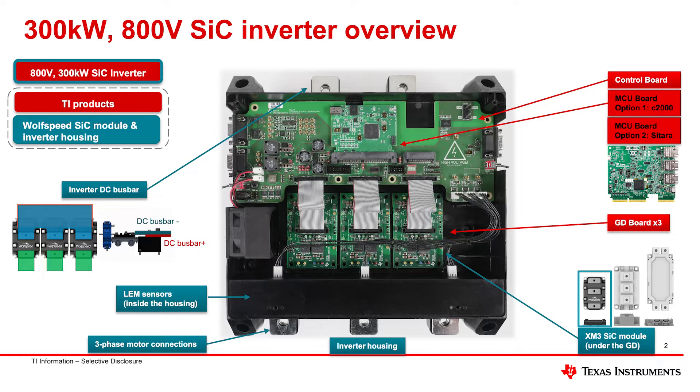One of the really cool things we did in Arkansas was taking apart one of these modules to look at what's inside — you can see the composition of how these modules are made and how it looks in die form. We also have current sensors located underneath here. So we have a system that can drive a motor: the brain, the DC bus voltage, the position sensing input, and the current sense — all the information necessary for FOC control.